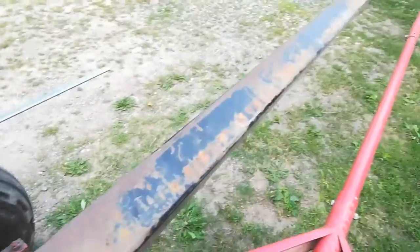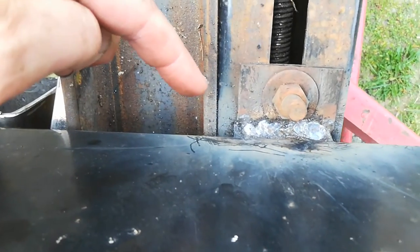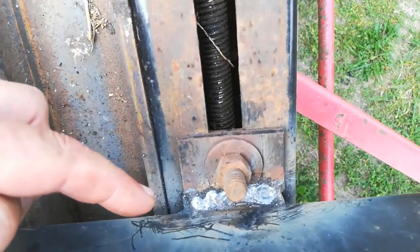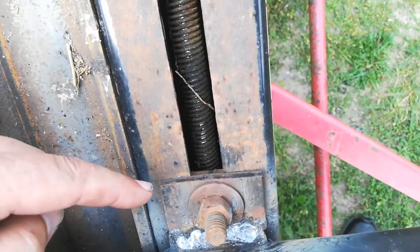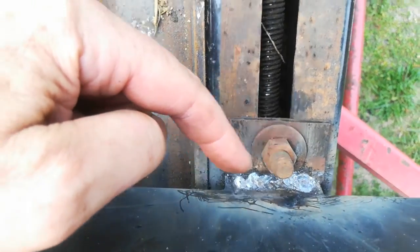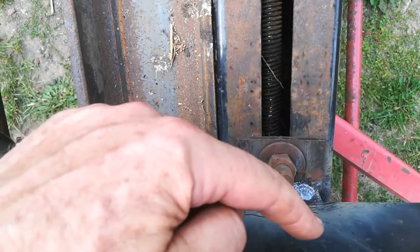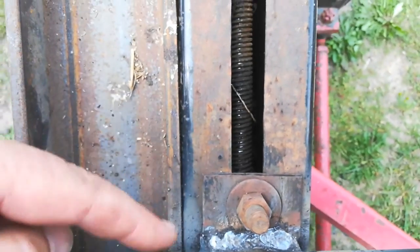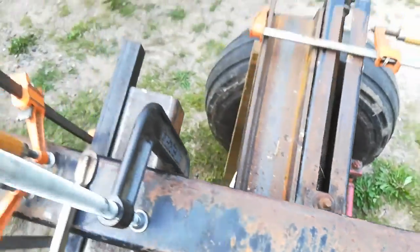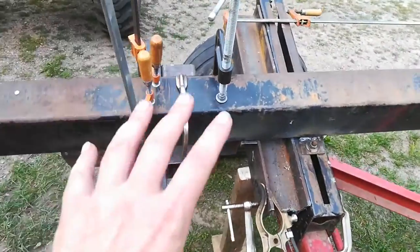The weld — I'm not the greatest welder in the world. It's still a little warm; that's the first pass. It's 6011, which is good on rusty and crappy metal. I tried to clean it up as good as I could. Really what I was doing is welding this plate to the piece of plate that goes underneath the tube, stitching that together, and then next I'll put two passes over the top. I'm thinking I'll build some little gussets that go from this bottom plate up to the side of the tube to reinforce it a bit better. In the meantime, until I can get it all welded up and the brackets in place, we're going to leave this whole contraption here.